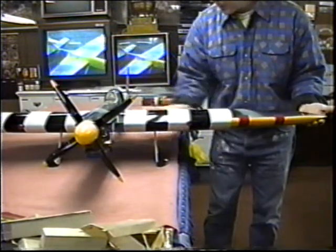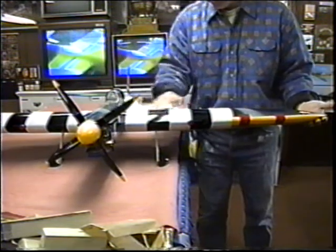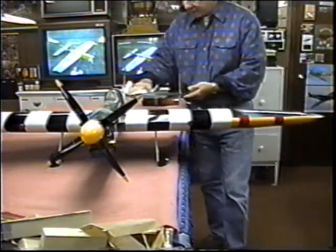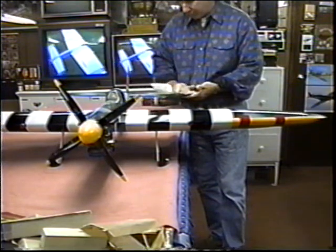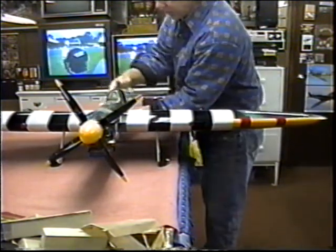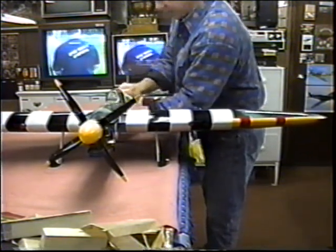Now, what I've seen a lot of people do is at this point in time, they take the plane and just stick it in either the cellar or a rack or something. And what typically happens, springtime comes, the tank is full of rust and corrosion, the filters all full of junk. They wind up inevitably getting about 7 lean runs on a motor, ruin the ring seal. Seen that happen over and over and over again.